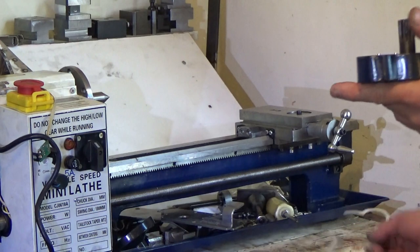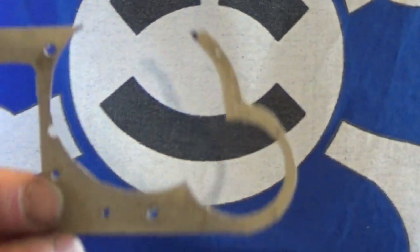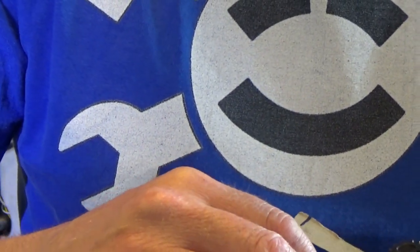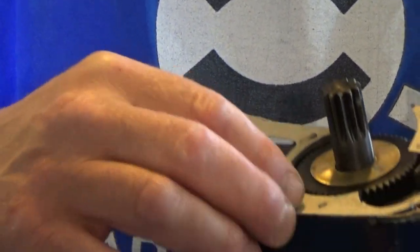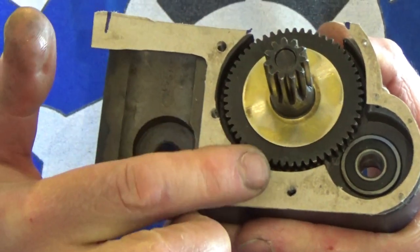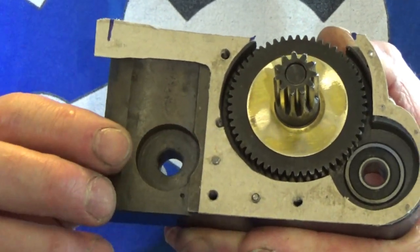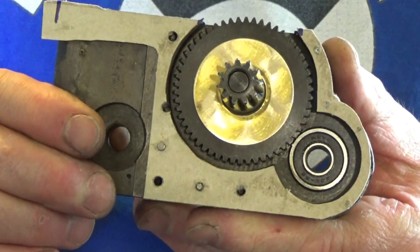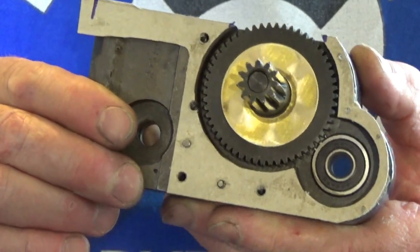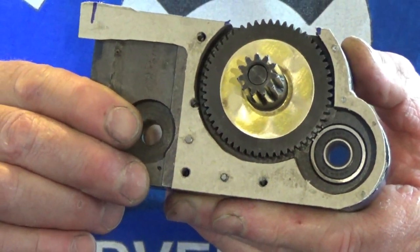And when I find the gasket, here is the gasket. So I've made a gasket. It's not great, but I think it will suffice. And the gasket's going there. I've ground the two pins to size and thread locked them in, so soft Loctite. And there's the gasket. So I'm going to put some grease on that gasket for sealant, because that's good for cardboard.